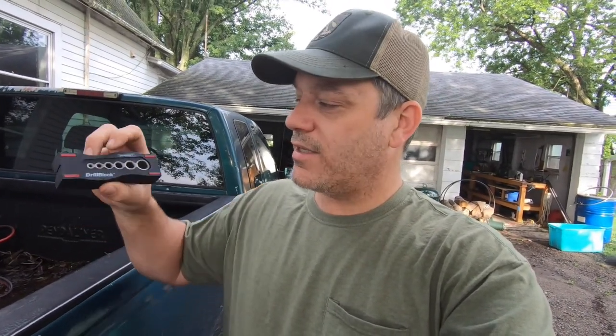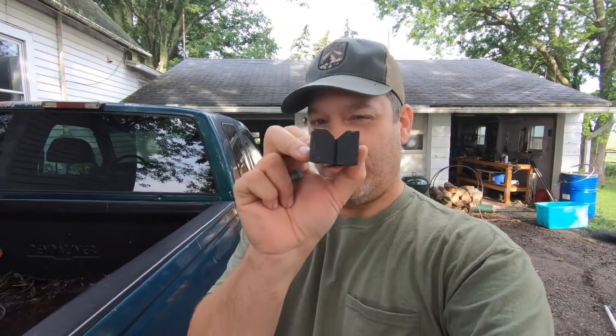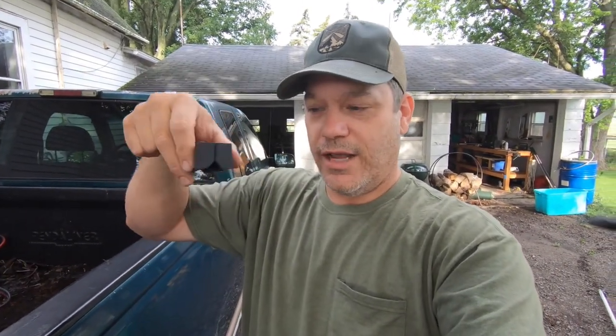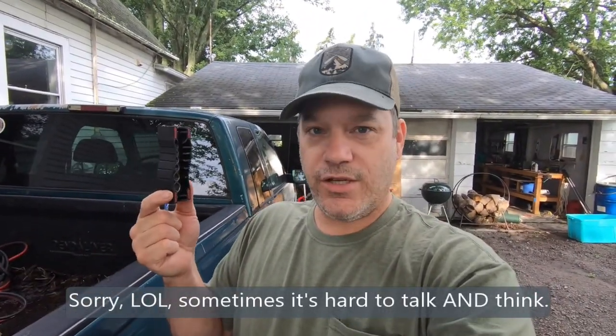It's not a review for it and it's not an affiliate link, but I just picked this up and it actually was very helpful. It's got different gauges in here for your standard drill bit sizes. It helps you stay vertical and straight when you're doing your pilot holes. And then also it's got this V channel, so it'll go around the conduit and you can pinch it off. You can clamp this to your conduit, and then it gives you a good guide to drill your holes correctly.